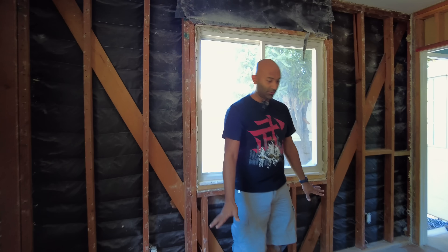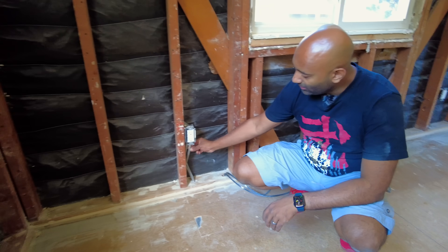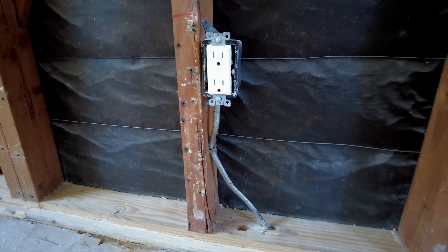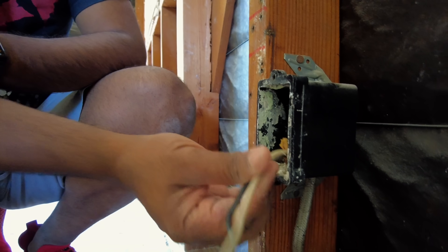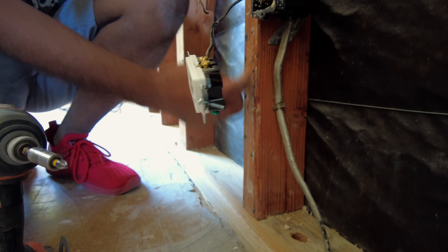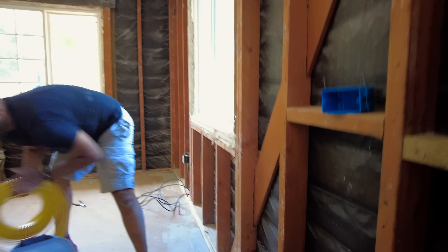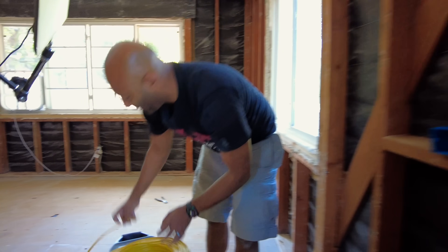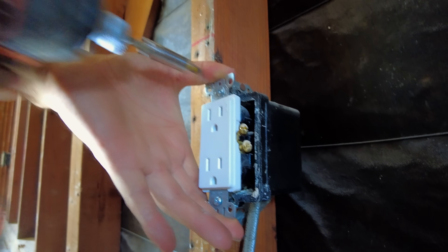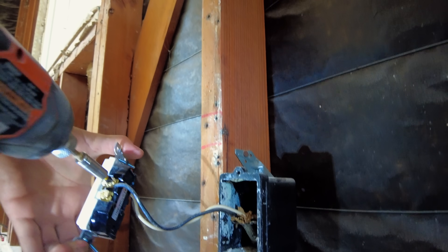The walls are all clear, the floors are clear. Next up is the dirty part that I'm not looking forward to, which is getting under the house and replacing all this older style electrical wire. And just as we noticed, there's no ground wire — it's just neutral and load, and that's the issue with this old style wiring. So we're going to rip all this out and replace it with 12-gauge, 20 amp rated Romex. We're going to unscrew all these outlets, unwire them, pull this down, see where it leads, pull it all out, and then replace it with new wire.